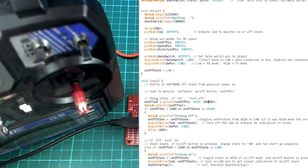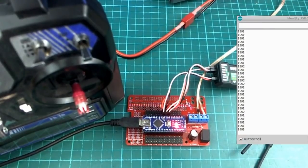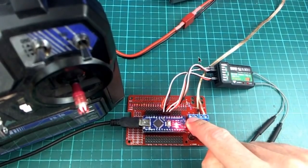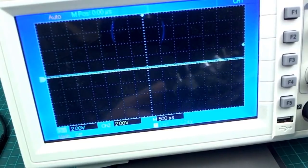Obviously in future I won't be using this — I'll be using my own radio system, probably using PPM to start with, and then an NRF24 module later on for something a bit more sophisticated, and also have some telemetry coming back from the wheelchair to let us know what's going on at the remote endpoint. I've noticed the voltages on the RS-485 bus terminals here are changing. I connected my oscilloscope to the RS-485 bus lines just to see if everything was working, and it seems to be fine.